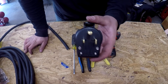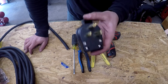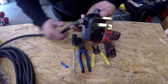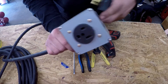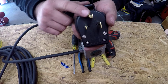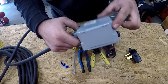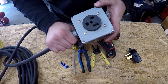These are the style plugs that come on a lot of the Everlast welders. I have an Everlast 185 DV — I'm making an extension cord for it. I already have the plug done. This is a 4-inch square box, NEMA 6-50R. A 6-50P is the plug; a 6-50R is the receptacle. I already got this one in a box — I did a 4-inch square plastic outdoor box, cut the tabs off, put a cable crimp in, and wired it up.